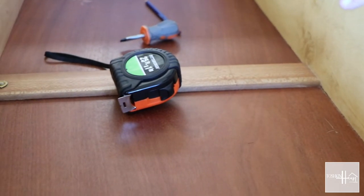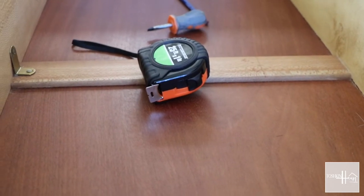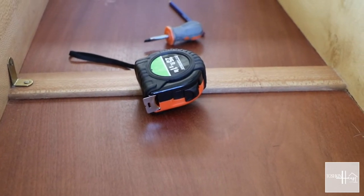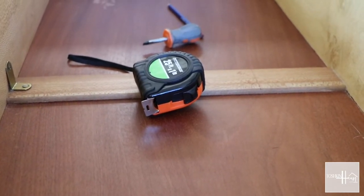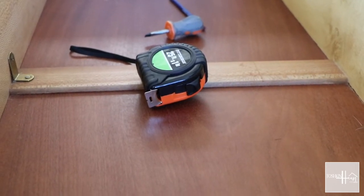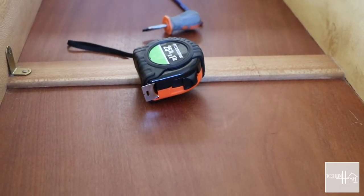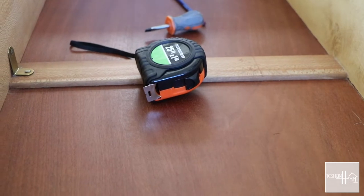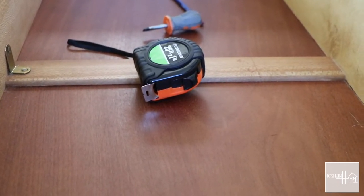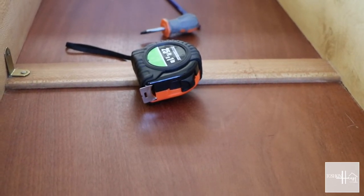So as y'all may have already seen, we're converting a 100-year-old dresser into our vanity for the powder room. One of the things to take into consideration when you do this is if you're doing it as a retrofit to something that's already existing or you're doing it for brand new construction, make sure you take into consideration where the water disconnects are, that you take your drain into consideration. Codes vary state to state. So work with your builder if the stuff's not already in place. And if it is already in place, you can get the measurements yourself.